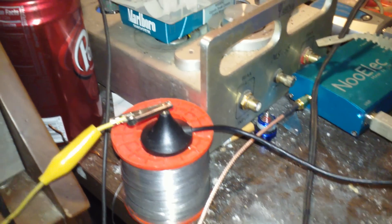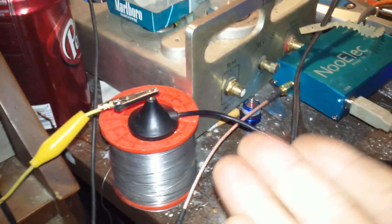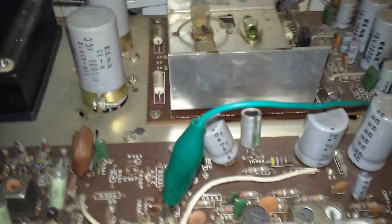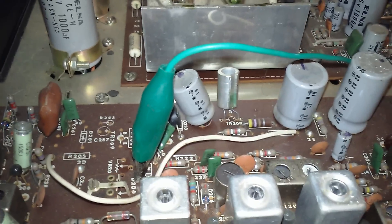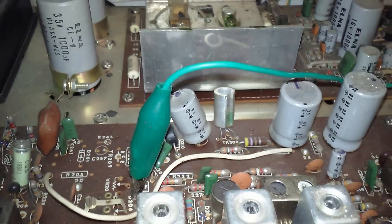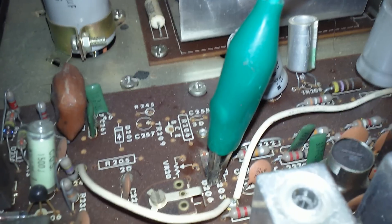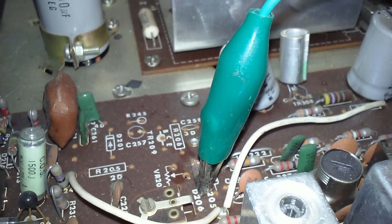That is literally just clipped into the base of my antenna. A lot of people have said these antennas were garbage — mine actually uses RG-174 coax, so I don't believe this is garbage. It's a cheap little base but it's very effective and it's shielded relatively well. Some of you are probably thinking, well, that's nothing new — we've done this before. You're right, it's been done before. In fact, they've talked about using RTL-SDRs as pan adapters for some ham radios. The difference is those radios were designed to have an IF output.